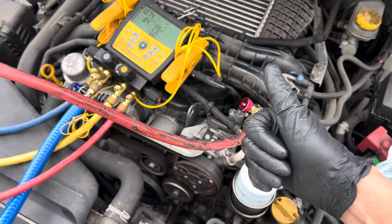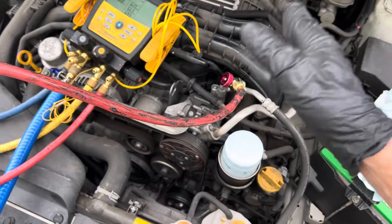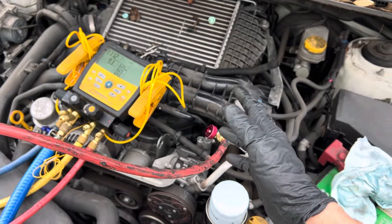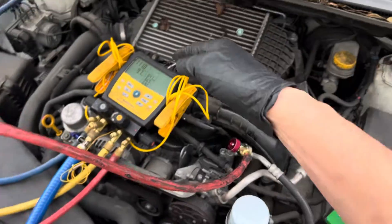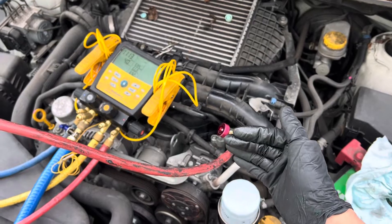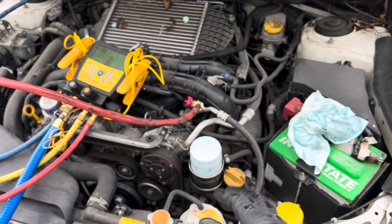Alright guys, I'll catch you later. I have more tests to run — I gotta put some dye in the system, run it with some refrigerant, prove the compressor is still good, and prove things while we're replacing the expansion valve because it's leaking. I want to make sure the electronics are working and the temperature controls are working. I need refrigerant in this system to prove everything is working before we replace the leaking condenser, the leaking expansion valve, and the leaking o-rings. I want to find all the problems, then completely fill it up with refrigerant, run some tests, recover it back out, and give them my full diagnostic — the big picture, as Chris from HVAC videos would say.